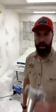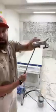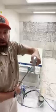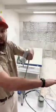Okay, so I'll talk you through a few things, and then we'll flip the door here. So how we teach our apprentices, and Brandon actually teaches a lot of apprentices in here. When you spray, what you don't want to do is be doing this, right? Because you're going to put a lot of paint on here and not a lot at the end. If this is your substrate, if you think about this here.